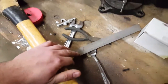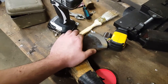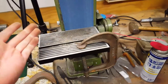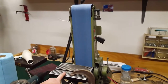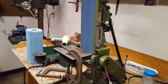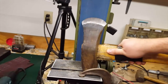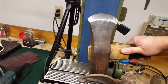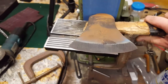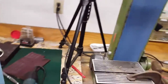I started with a file just to get it a little smoothed out because it was really bad. Then I came over and clamped a C-clamp onto my Harbor Freight grinder. Once you get the C-clamp there, you use that to set your angle — just sit your axe like this. With the sander on, you rock back and forth uniformly, and every now and again check the other side to see what it looks like and if there are spots that need more attention.